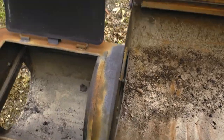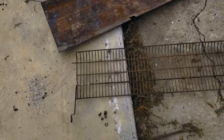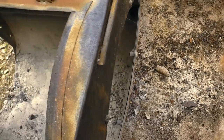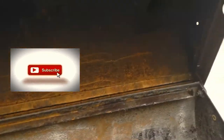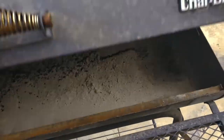While we're at a good stopping point, let me show you where we've gotten. We've taken all the grill grates out and everything broken down. We're going to scrape them down, probably repaint that one, sand everything down, get ready to get fresh coats of paint on some of these and re-season the others. We're going to rinse out the firebox. There was a big gap from over time of moving the grill around where it separates, so we tightened the screws back up. We're going to get a bunch of water in here, rinse it out, and lay fresh high-temp paint down on the inside. Anybody can do it — just a little TLC. We're going to get the stack off, sand it down as well, and get this thing some new life for a little cost.